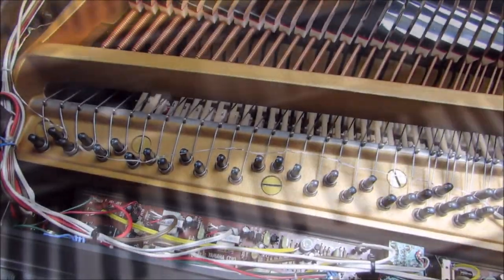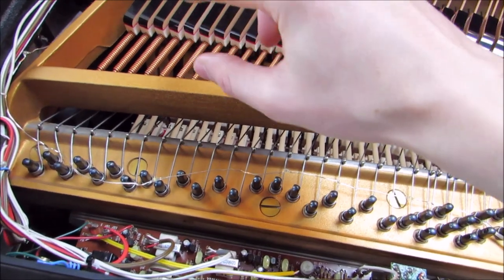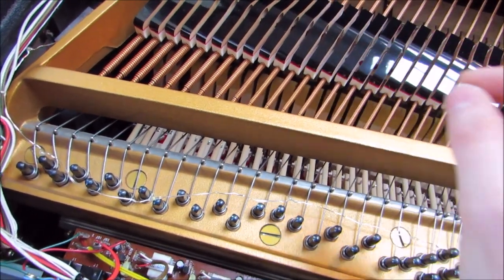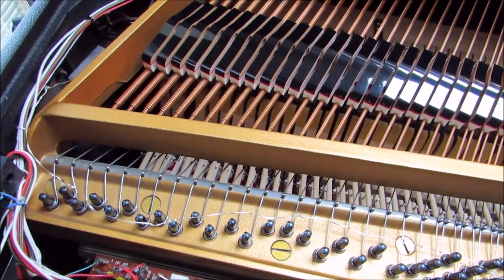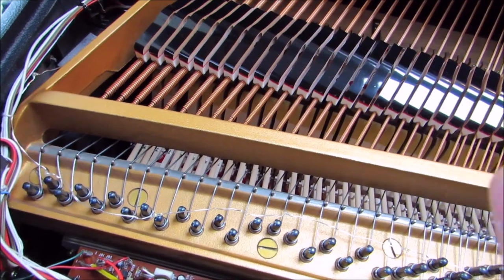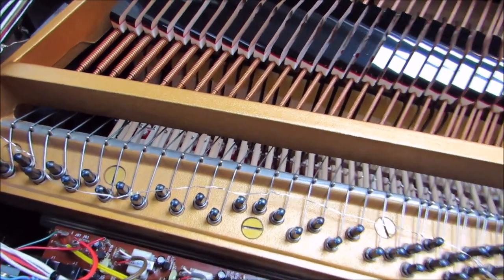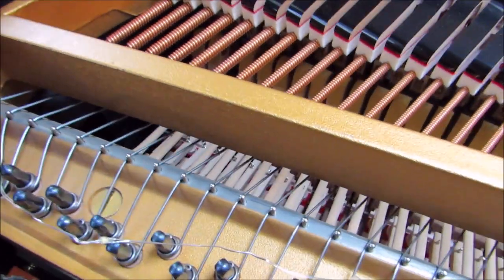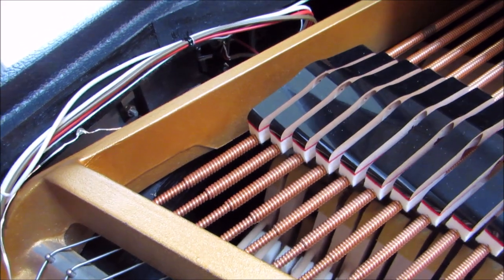So what I was noticing, as I said before, was my XLR as well as one of my unbalanced outputs was not getting any signal. So pretty much what I found out, the same with my CP-70, is that since these are portable, they're moved around a lot and connections become loose. So what you're going to be wanting to do is, if you get a wiring diagram, that will be even better. That's what I ended up doing as well. You can get those online.